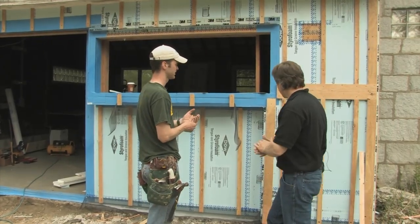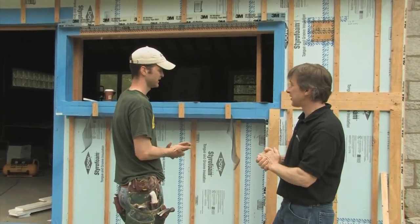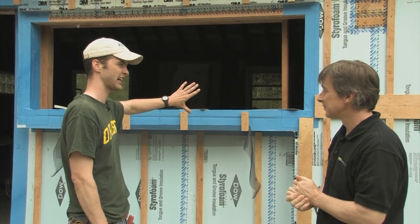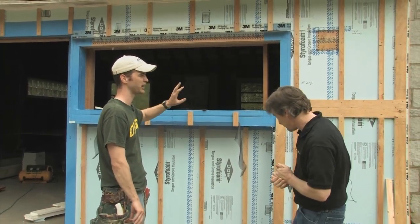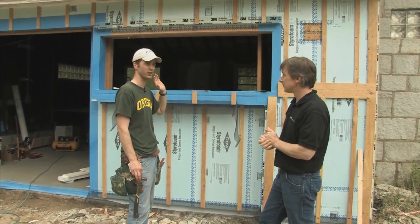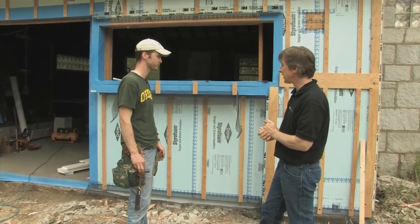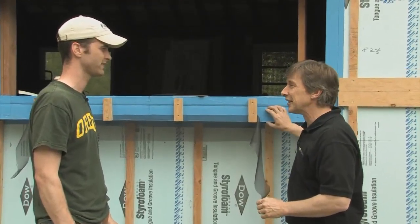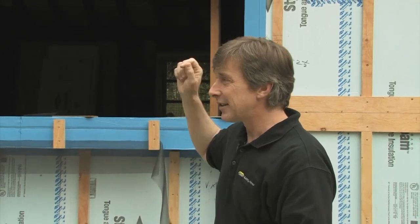We're making good progress, maybe a little slower than hoped, but that's what happens with really cut-up walls. What we've learned: what used to be considered the rough stage of building - the framing - if you do it this way, it's the details that count. This is as fussy as finished carpentry. Definitely sweat the details, and also note that small pieces of foam compress. Next time we'll be setting those doors, then insulating, drywalling, adding a subfloor, and building some cabinets inside for a table saw.